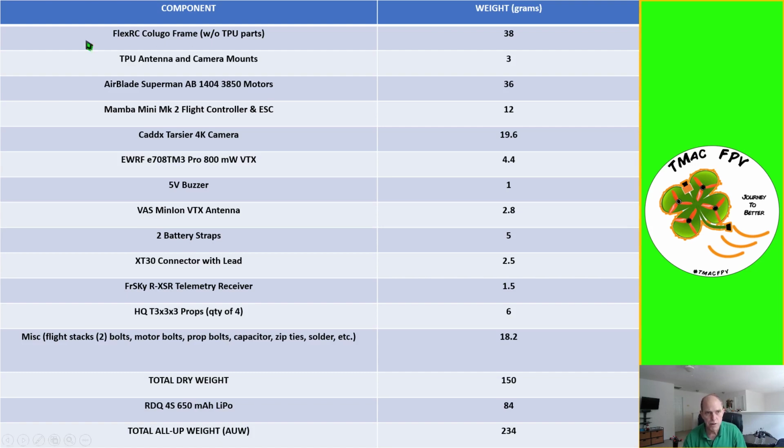We've got a similar document for your Micro FPV motors. We've got the Micro FPV motors chart, which you can download through a link in the video description below, and that contains over 45 different motors from a boatload of manufacturers. In that motors guide, we compare various parameters as well, such as the number of cells of the LiPo that's supported. One of the key parameters that we do list in that motors guide is the thrust to weight ratio. So if you're comparing 2 different micro motors that are able to support the same number of cell LiPos and they're approximately the same cost, you might want to look at the thrust to weight ratio to figure out which one's going to give you the best performance.